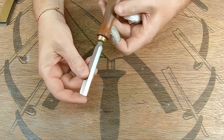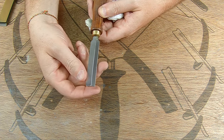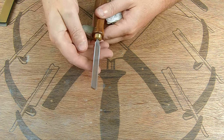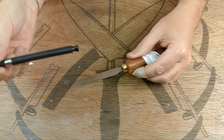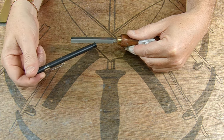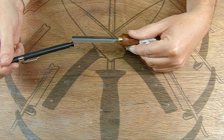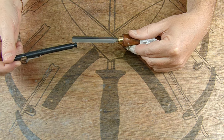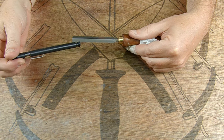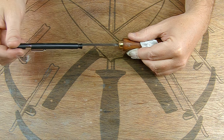I want to check the consistency of the bevel here. I can see a thin line along the top of the bevel and a thin line at the edge, so I know I'm hitting it. Again, the precision is there, and I know I've gotten it because of the hollow grind. So I just want to check with the edge tester — I've got a 45 degree angle, just nice and easy. It should be consistent; you don't have to use your thumb for everything. I'm feeling a very even grip to it — I feel sharp. No pressure, just running it along at 45 degrees so it doesn't hit any bumps. No chips — it's consistent across the board. We'll move on to the 9 micron, which is about 2000 grit, and we're going to finish it on that.